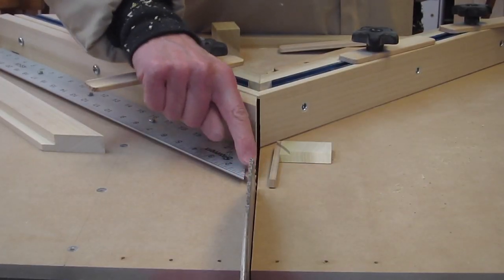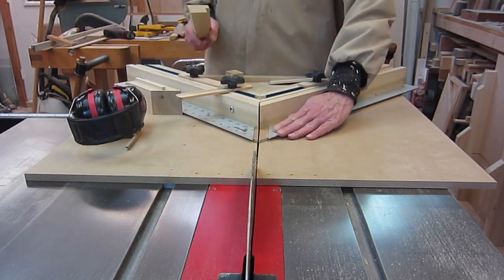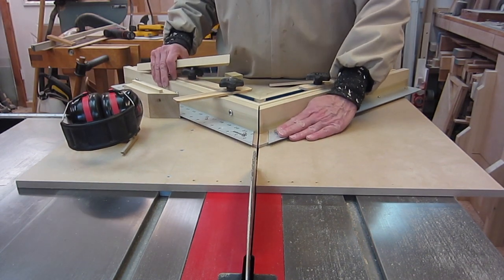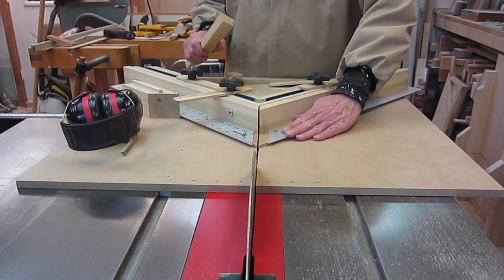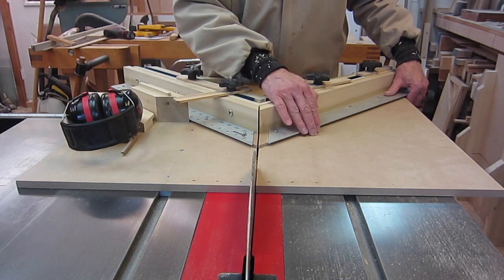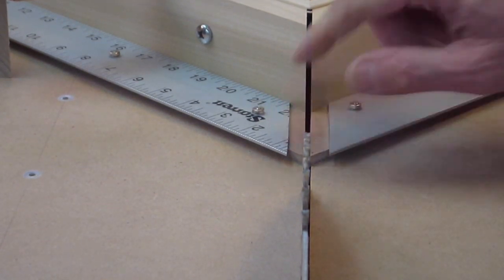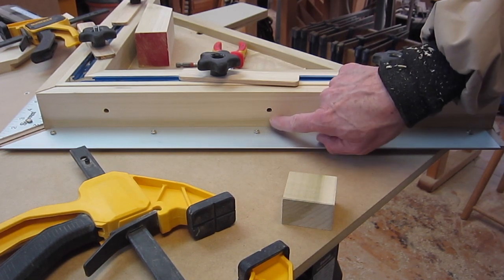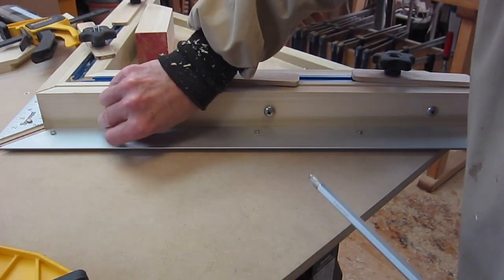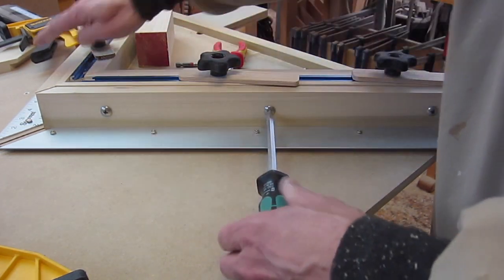You'll notice I've got about half an inch spacing from the blade to the metal ruler. First cut, second cut — that means I don't need a scale on here and I turned it upside down just to avoid confusion. If this scale ever wears off or gets damaged I can swap the rulers around and I'll have a fresh one. The position of this doesn't matter as much, but I'm going to line it up so there's an equal amount of space. I drilled these holes one sixty-fourth of an inch larger than a quarter inch, which makes the screws go in easier since the exact position here doesn't matter — whereas over on the calibrated side I didn't want any play at all.